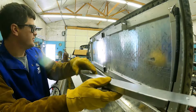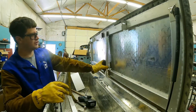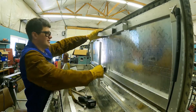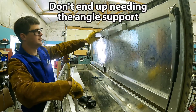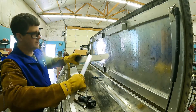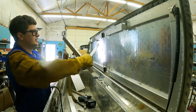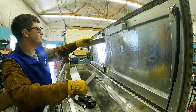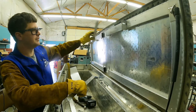I have this marked out to cut. I'm going to sit right up over that, basically trying to ease up like that. Then I'll run this angle iron down as reinforcements in that direction. This will be a better repair — I'll probably do like three plug welds across this, and then as best I can hit down in here and up across the top. I don't know if I'll be able to reach in very well across the top there, but that'll be perfect.